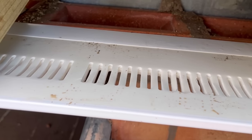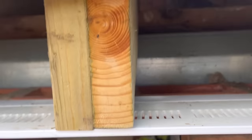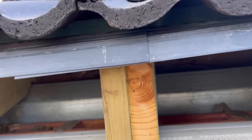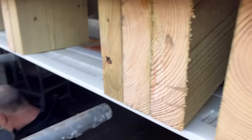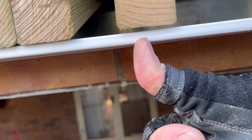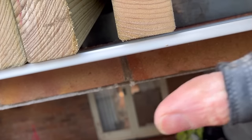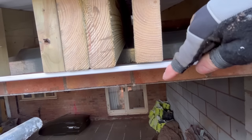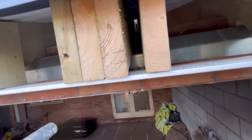You can see the starter trim at the back there now. If I get my finger there - that's been screwed up to these blocks. If you remember, I put these blocks on the side of every rafter. Then you get your soffit, you clip it into your starter trim. Mick's down there fixing some screws up into there, and it gets covered then by the hockey stick of the fascia, which goes on and clips up inside it.